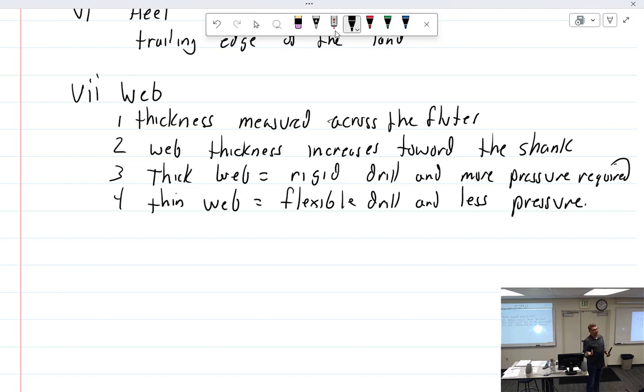Now, you think, well, it's not going to flex, but I use a lot of times number 3 drill bits that are about that long. And I use them a lot, and they're fantastic for when you can't reach, you can't get your drill into someplace. When you've got a bend, I'll just literally bend the drill bit and start drilling. I'll grab it, and you want one that has a very long shank and not too much flute on it. You can bend it a pretty fair amount, and I'll bend it into what I need to and start drilling. My hand gets a little hot doing it, but you can actually do it.